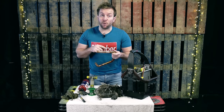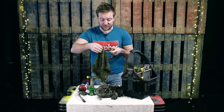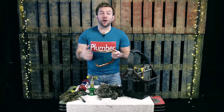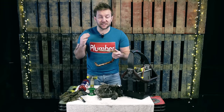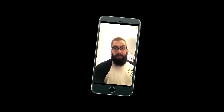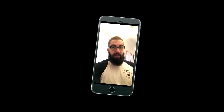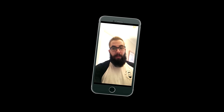A good thing to do at this point — and I don't see this in many other YouTube videos — is to wipe off any excess flux that's around the outside of the fitting. My tip for a nice solder joint would be to remember to wipe your excess flux off before you start feeding the solder. It stops it from running further than you need to, getting any snotties on the bottom. And remember to feed it, not wipe it.